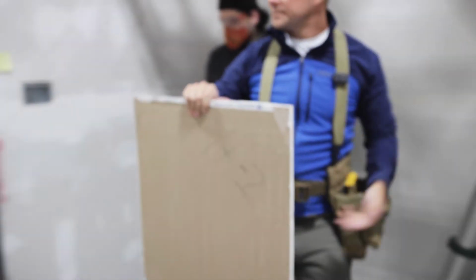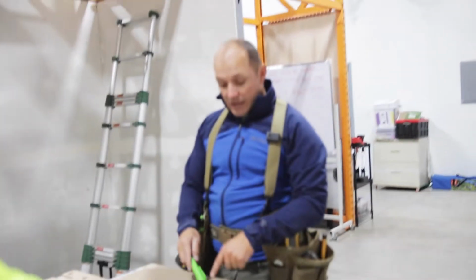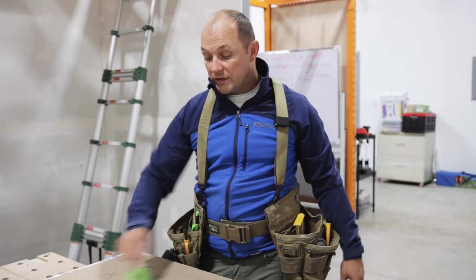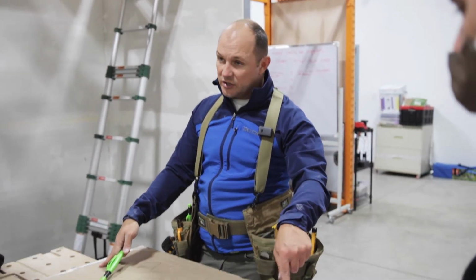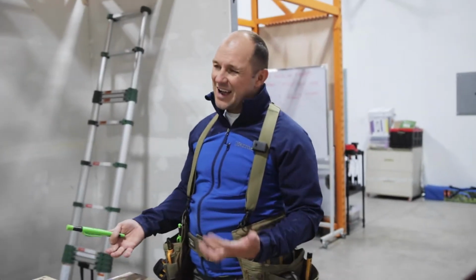So if they already have their own, do you put this on top of it? Usually, how I like to do it is you use whatever they have. Whether it's the paint, it's garbage, and replace it. We'll cut a piece of OSB this size. We'll glue this, put the OSB on. And the reason we do that is we need something to secure this to. Because this is old, junky, falling apart. We need that hard board.